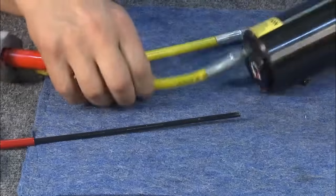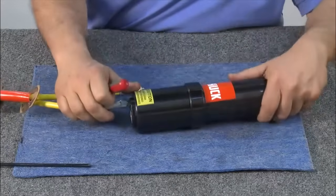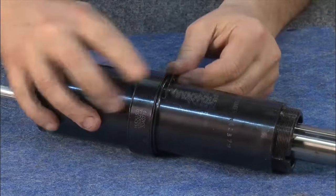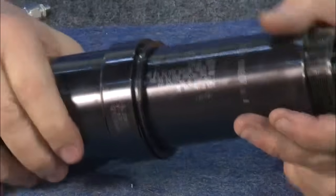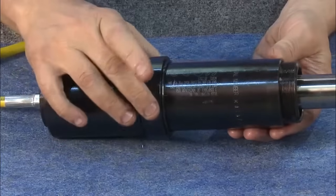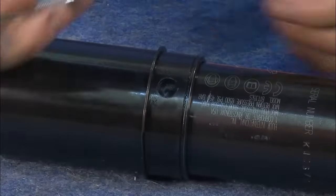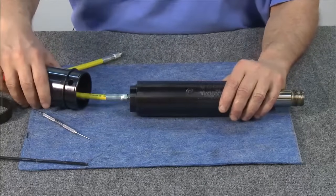The BTT35LS features twin pistons. Now we need to remove the shroud so that you have easy access to the rear piston. First, remove the spiral lock retaining ring. Next, slide off the sleeve. Then, remove the locator buttons. Next, slide the shroud off the back of the tool.